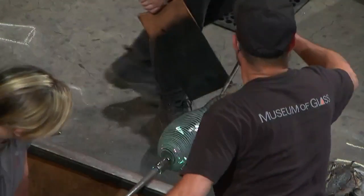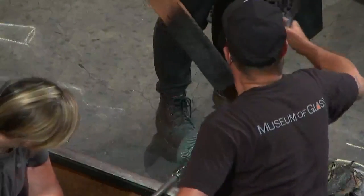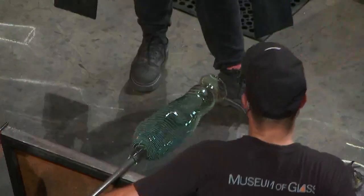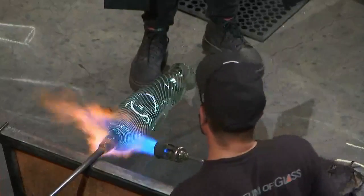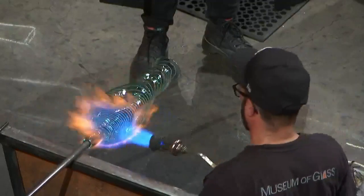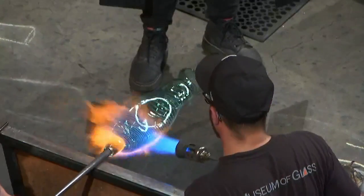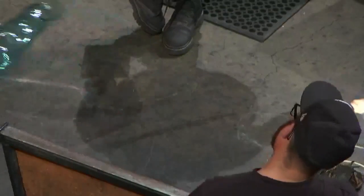Now, we purchased this glass. It's manufactured about 45 minutes north of Seattle, called Spectrum Glass Nugget. We're seeing down on your right-hand side of the hot shop, our furnace down here is running a little low on glass. When we have anywhere from 400 to 600 pounds of glass left, it is then time to recharge it. Fill it back up with more glass.